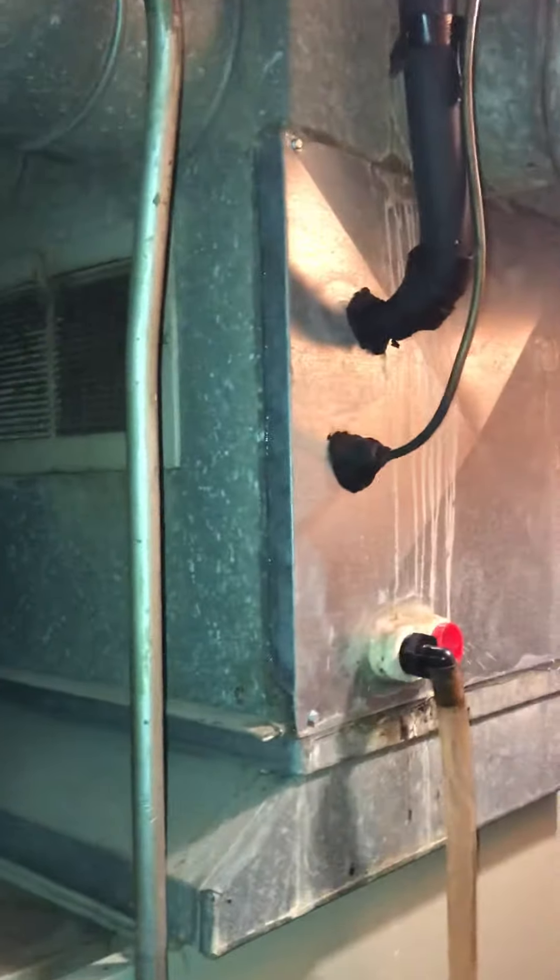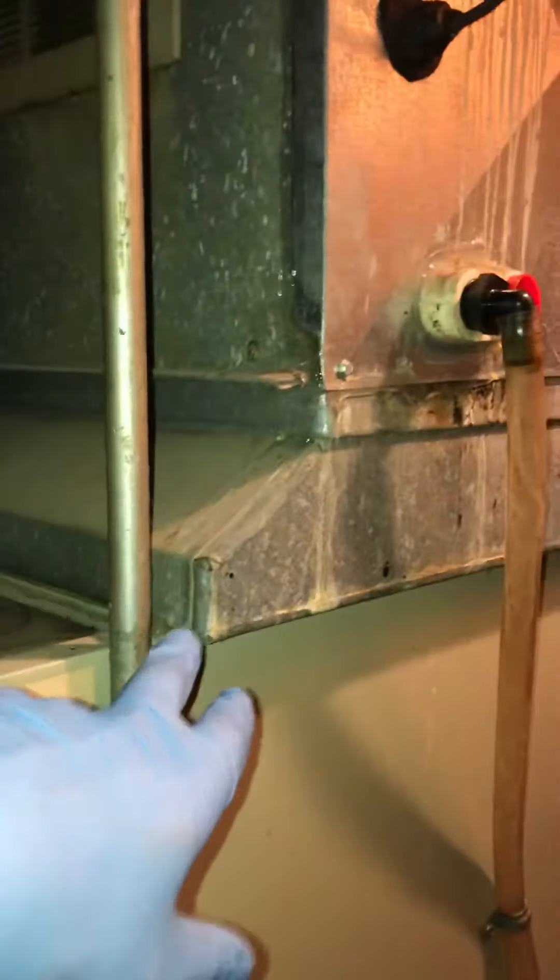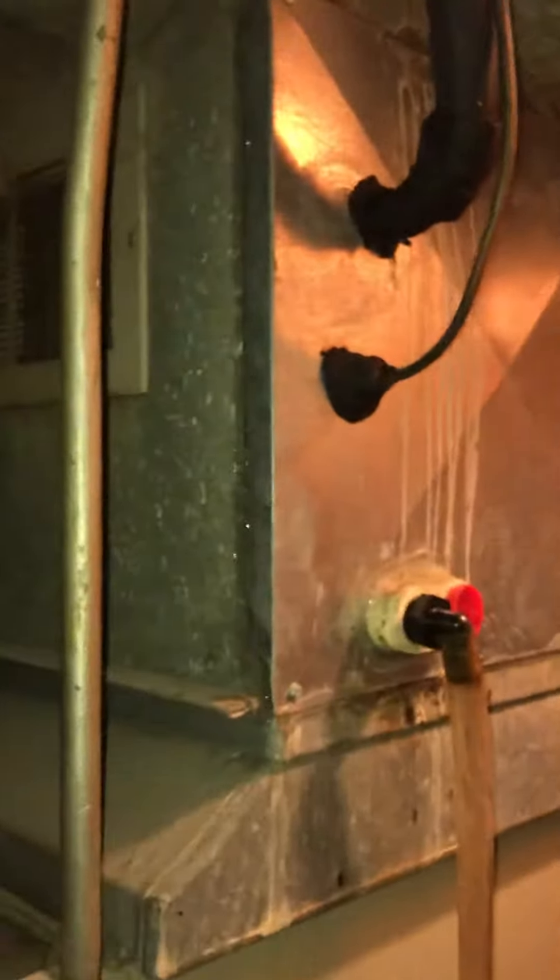The return is a massive round — looks like it's about two feet. I haven't seen one of those before. We're pretty tight on space from the top of the furnace to just get underneath these six-inch ducts coming off. We've got 19 inches from the top of the furnace to just underneath these six-inch rounds. There's a transition that someone else has done to get a coil in there.